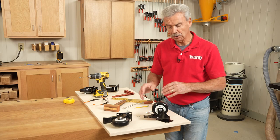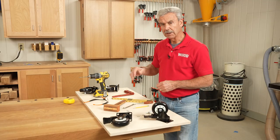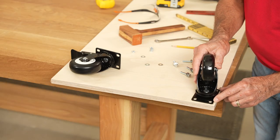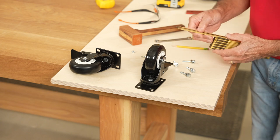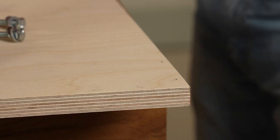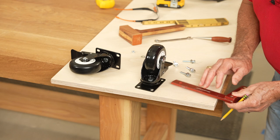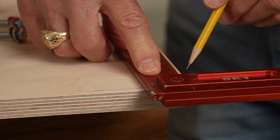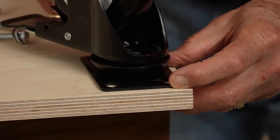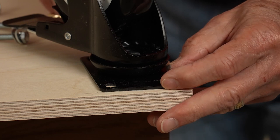I'm going to apply the casters in all four corners. On one side we'll have the locking casters, and on the back the regular casters. I want their offsets in the front and sides to be a quarter of an inch, so I'll use my ruler to set this up and mark these out. These are quarter-20 bolts with washers and lock washers on one side, and just a washer and a nut on the other side.